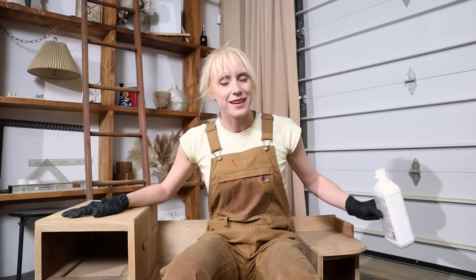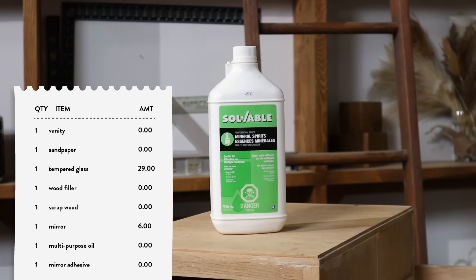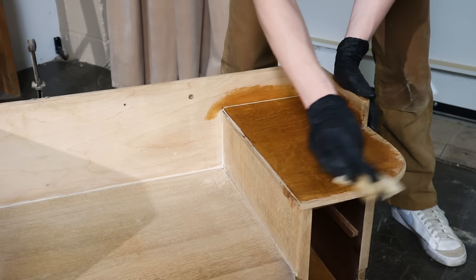I feel like this piece is sanded to the best of my ability — it's looking so good. Before I go for staining though, I want to hit it with some mineral spirits. This is just going to prepare the wood surface. Because it's pretty obvious that this has been painted before in the past and then removed, there's actually some paint still stuck in the wood grain, so I think if I hit it with mineral spirit we'll get rid of that, and then it just dissolves on its own.